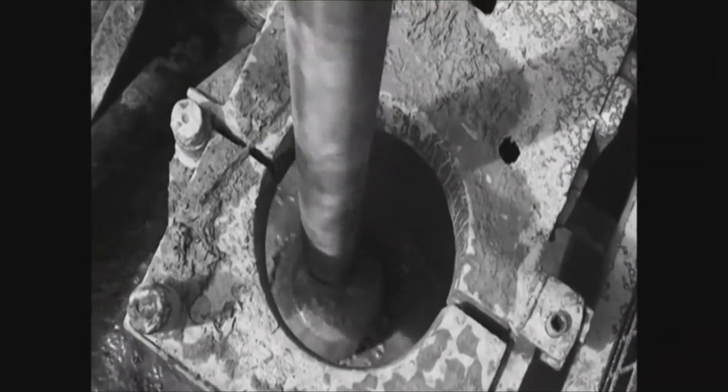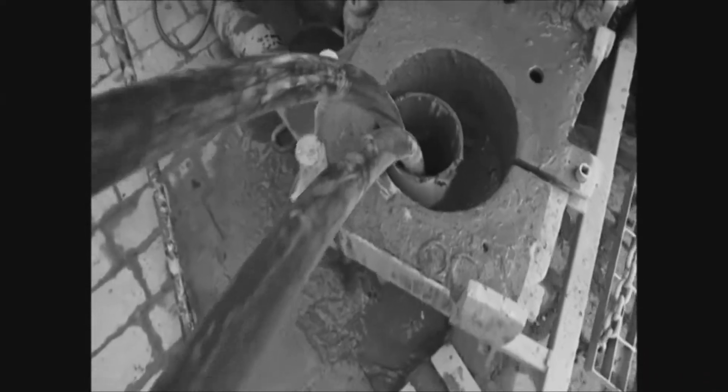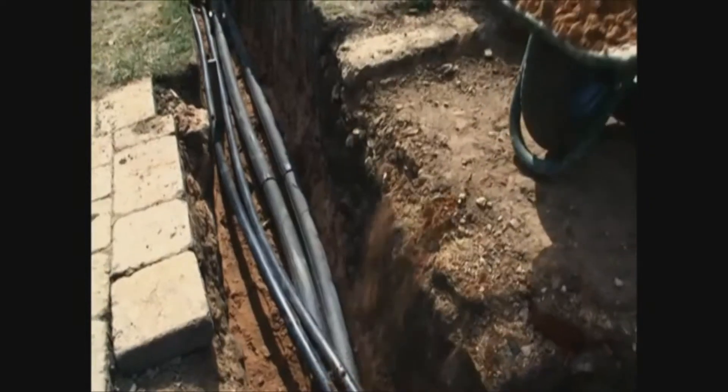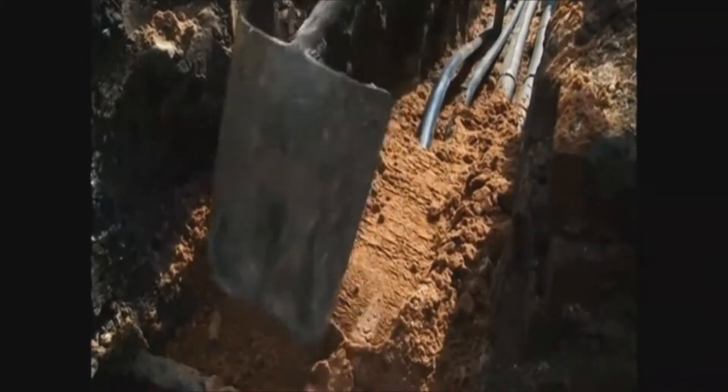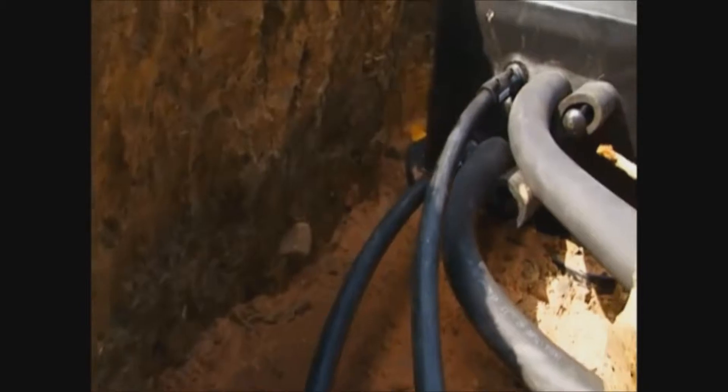On this installation we've got four boreholes. The borehole manufacturers that came in and did the drilling have actually pre-tested the boreholes so we know they're okay. So what we're going to physically be doing today is just pressure testing the pipework that's at the surface level. The pressure testing is there to make sure that the pipes are okay once they're in the floor. Once we've backfilled we don't want to be coming back to them, so the pipes get pressure tested for a period of time — normally a minimum of about an hour, but the longer you can leave it the better.